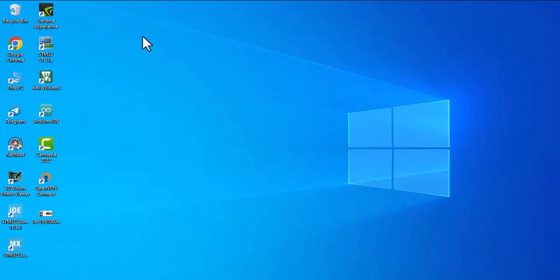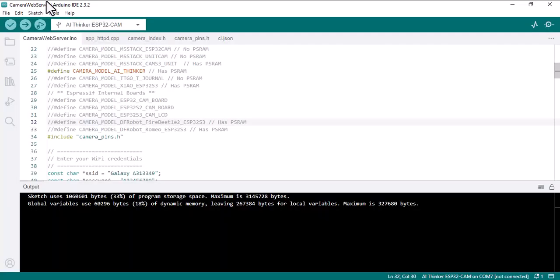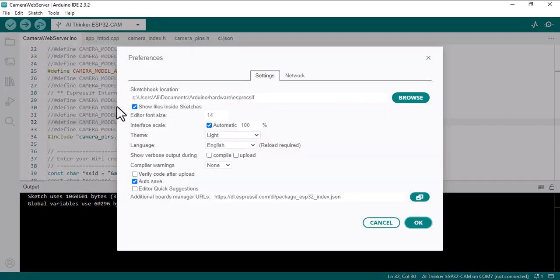Next step is to download and install Arduino IDE, which I have already done. And let's open it and go to File, Preferences, Additional Board Manager URLs. You should provide this address here. I will put it in the description. Then press OK.